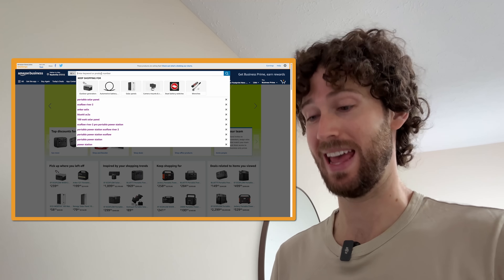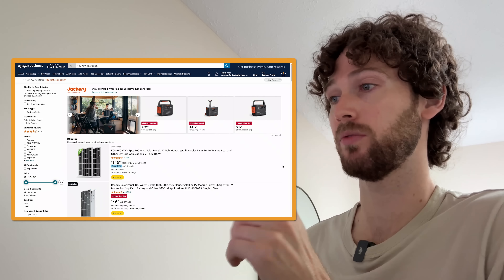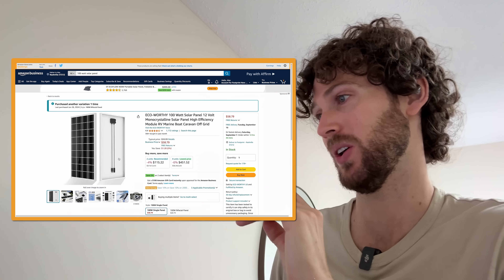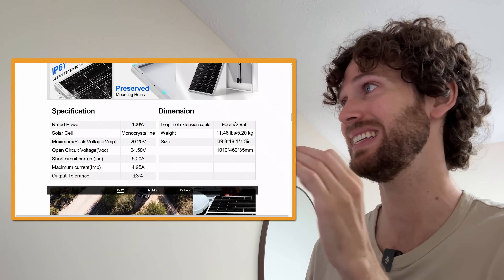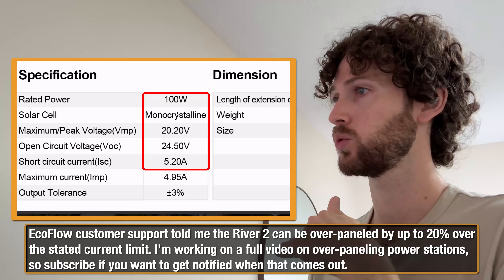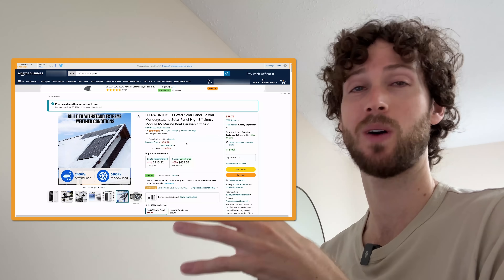Now we just need the solar panel and I think we could get away with a 100 watt solar panel. This wouldn't be a portable panel because portable panels are just way more expensive. The EcoFlow River 2 has a 110 watt max solar input, and there's a $58 100 watt panel that might be within our budget. The power station's solar input is 8 amps max, 11 to 30 volts, 110 watts. The panel has a 24.5 volt VOC — that's within the limit — and 5.2 amps ISC, also within the limit. So this very cheap 100 watt panel is compatible.